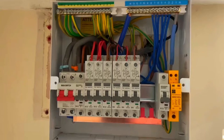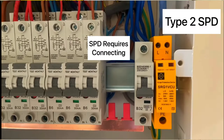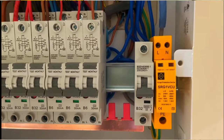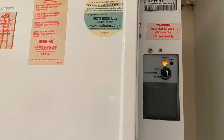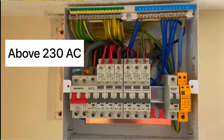Let's take a look at some of the benefits of having this new consumer unit fitted. Starting on the far right hand side, there's a Type 2 SPD or surge arrestor. We've got a surge device installed there in order to offer some protection for items that are in circuit — so things plugged in like your TV, electronic components, mobile phone, tablet, games console, PC, and the electronic equipment within the oven and boiler — all of which are sensitive to over-voltages, meaning rising well above 230 volts within the installation.